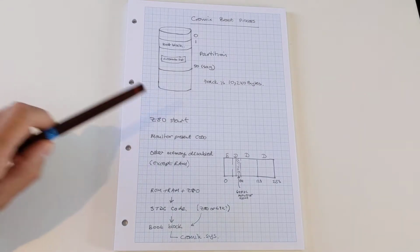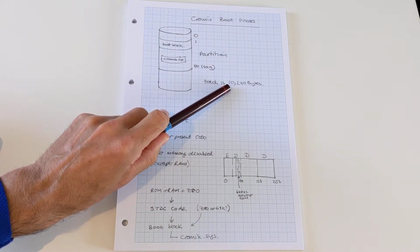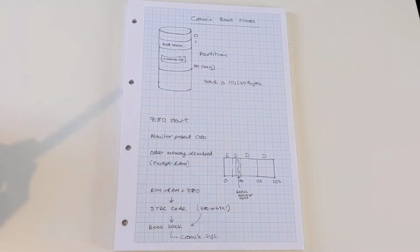So a track is exactly 10k in length, and there's some bytes before that 10k of data and some bytes afterwards, including CRC and stuff like that. But it doesn't use the conventional sector formatting that hard drives would normally use. It uses track formatting, and it would store that whole track in a buffer on the controller itself. So the idea is you're going to get much faster throughput, etc. But let's look at the actual physical disk.